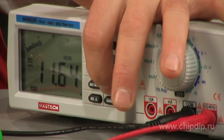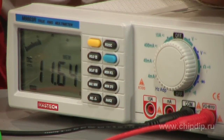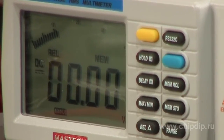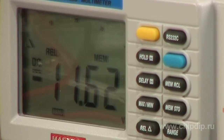The MemStore button saves all measurement values into memory. The Rel function is a relative display — if you press the button, the Rel indicator appears and saves the indicated value as relative. When this function is activated, values on the main display are shown as the difference between the saved relative value and the current measured value.